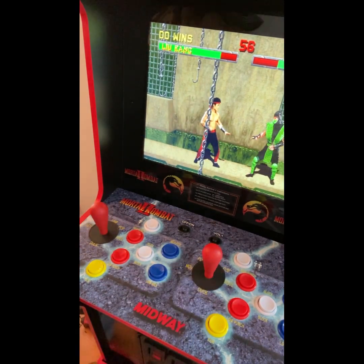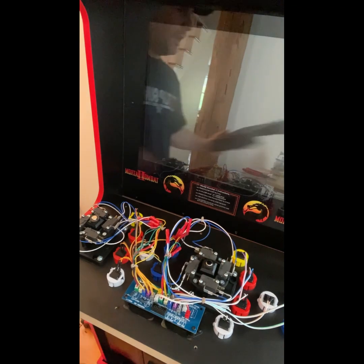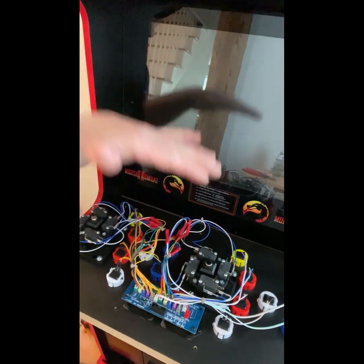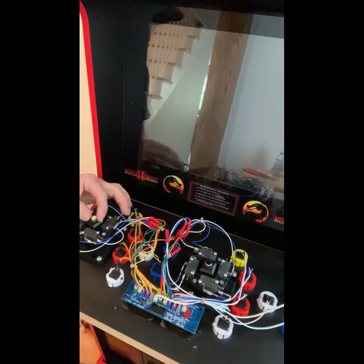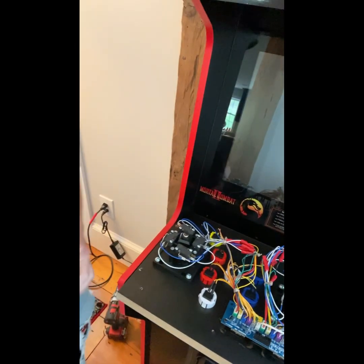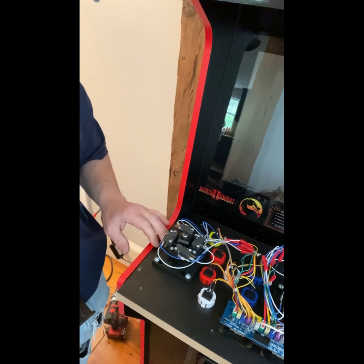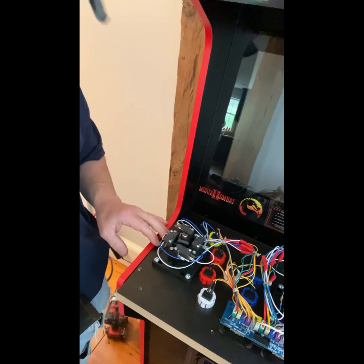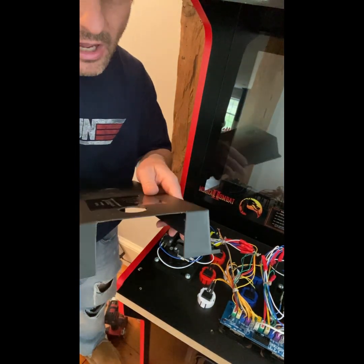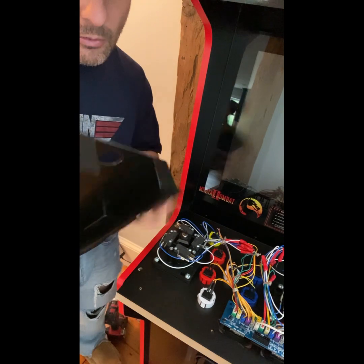I love it. Next thing I want to talk about is the deck protector. So of course when you use these Happ controllers, the depth of these little circles where the controller actually moves around does hit and bottom out here. And as well as way over here on player 1 side, this does also cause a problem. So this is what I did for player 1, I basically just notched out my control deck, nice square edge there.